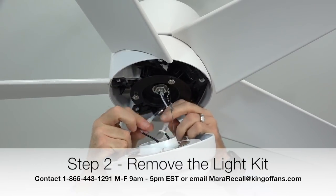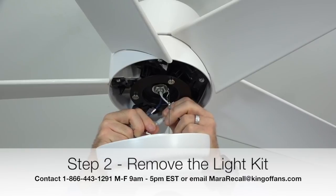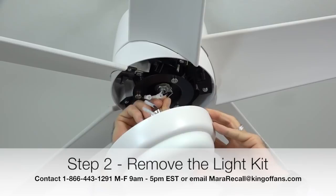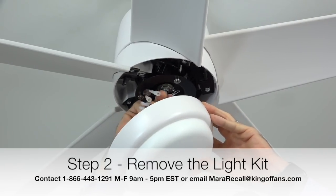Remove the light kit from the fan by pulling the magnetic light kit pan down. Disconnect the wires from the light kit assembly from the wires from the fan motor assembly by pulling the molded adapter plugs apart. Disconnect the safety cable of the light kit assembly from the hook on the motor assembly.